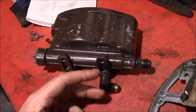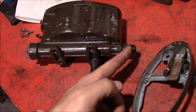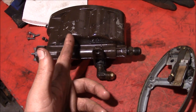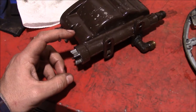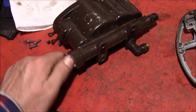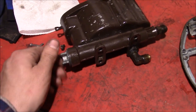Let's back up and give you some basics. This right here is the oil inlet, where your fuel is coming in. It goes through the control valve and exits out the bottom — this is what goes into the burner on your furnace. This back here, come to find out, is actually a cleaning port, or inspection port, or service port, for a filter.